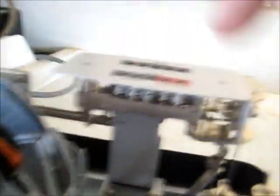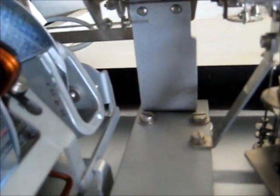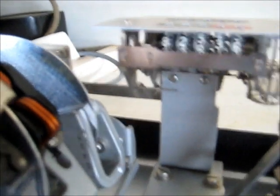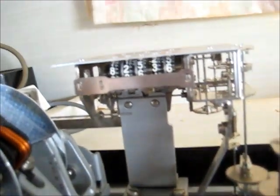This little... looks like a PCB printed circuit board type substrate material. So it drives off that through to your main drive here, which drives to your readout, your reading. All these number wheels are all made of cast aluminium — although they look pretty clean, so they could be steel. The Geneva wheels here on the back that flip the cogs between the wheels are made of the same metal. So it's all steel gears.